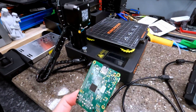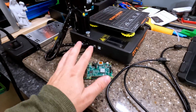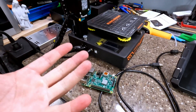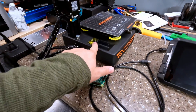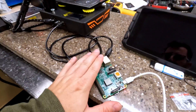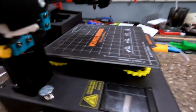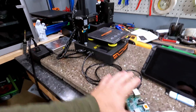Next, I have a Raspberry Pi with an SD card containing a Klipper install pulled from another computer — a known good, functioning install. We're going to plug this into the printer and see if it emulates the problem. This also doesn't have a printer.cfg for this printer, same situation as the Sonic Pad. Result: no smoke, no heat, filament is cold. So it's not the Raspberry Pi.